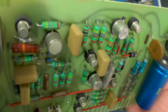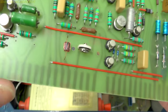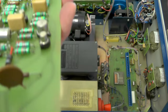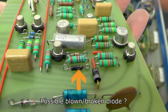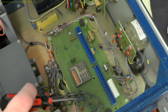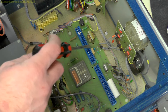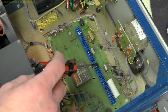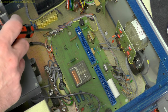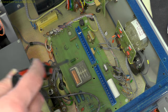Here we've got some nice old school transistor packages and cans - there's going to be a voltage reference in here somewhere. A little inductor here, and I'm surprised that's not been gunked down with something. They've put small little loops in these devices to go through the PCB. I've got the other part of the control board - there's a 16-pin device there we'll have a look at in a moment. Looks like a bridge rectifier, small transformer or choke, an edge connector, and a nice PCB-mount relay. There's an old school glass passivated diode just tagged on here.